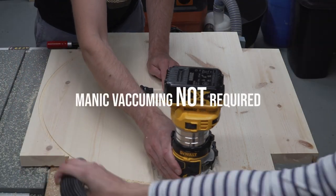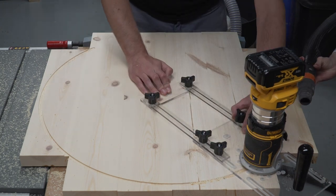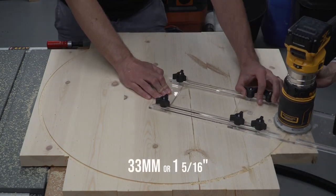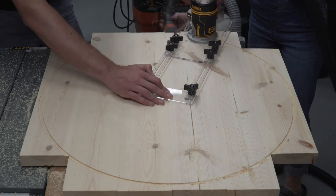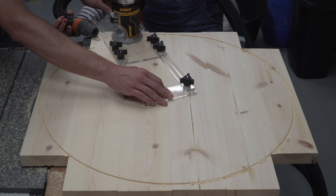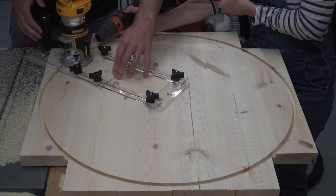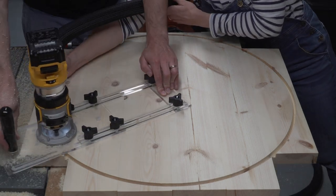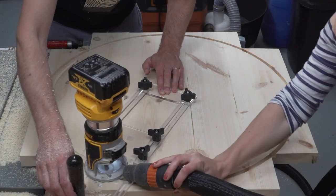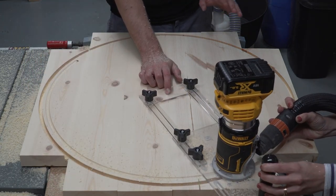The jig is a bit of a transformer, and in this configuration we cut the outside perimeter. As the material was thick, we only cut about halfway through. We haven't cut many circles like this before and were pleasantly surprised just how easy and accurate it was — really fun as well, so we need to find more excuses to make circular things. We then moved on to cut a groove with a round nose cutter. The rim of the fire pit will seat in this groove, as well as serve as a drip stop to stop any water finding its way into the fire pit.